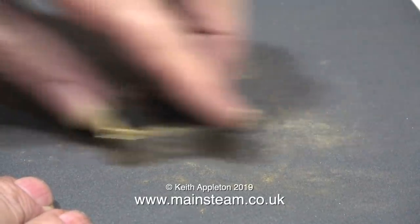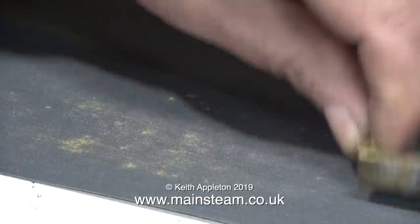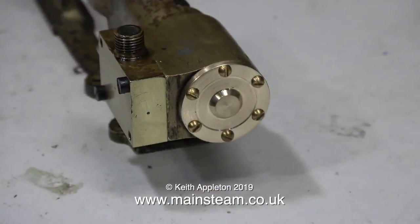Parts of this engine are not very well machined — the steam chest was left in what I would term a rough cut. Here I'm removing the tool marks on some wet-and-dry sandpaper, and it does look a good bit better when finished. I fixed the steam chest cover in place very loosely using a couple of the original bolts; I'll probably use cheese-head bolts for the cylinder cover too. The engine is starting to take shape. The next job will be machining the crosshead, but that's it for this episode — thanks for watching and I hope you found it useful.